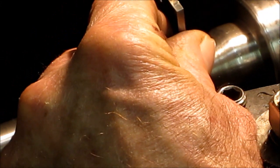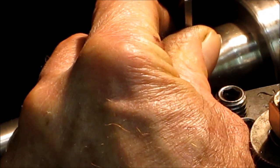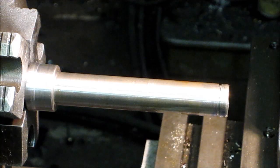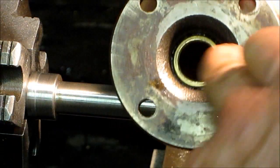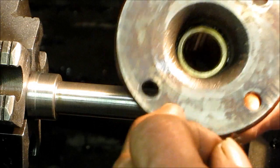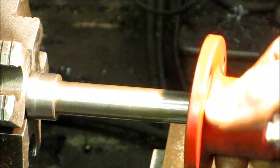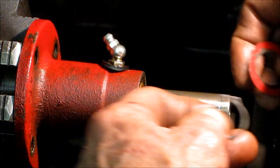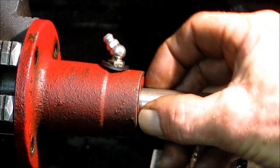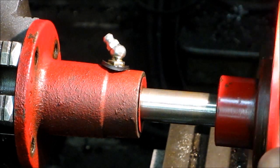Alright, let's see what we got in here — we're about .698. Here's our stack-up: we skimmed the OD of this little register in here because this is cast and it's off-center. We took it down to bare minimum so it has clearance, but it's given us that thrust against that bushing in there, which that bushing used to be a bearing. Now he wants to run that thrust ring in there, and then here's the actual hub.